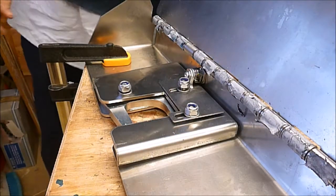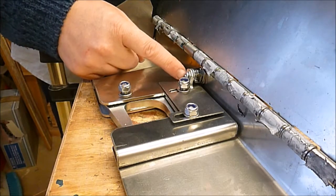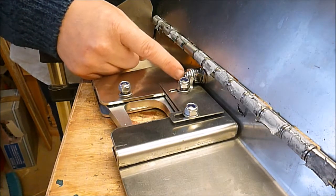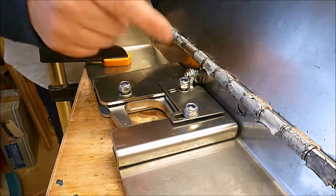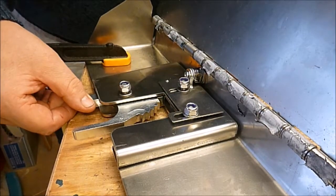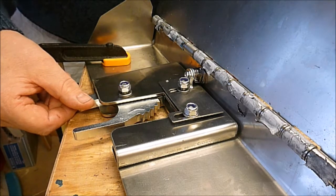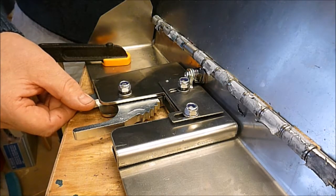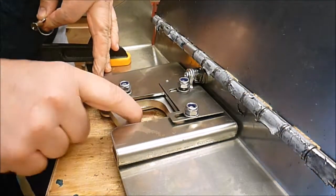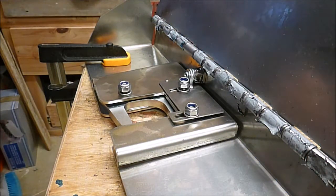We'll try that once more. Operate the key — you can see this bar here only moves a small amount. It's just pushing against the spring which finishes over here so that you can open the ratchet. It's not supposed to move more than a few degrees. Take the key out. As you push it in, that's the ratchet. The mechanism now works and I'll go ahead and tighten up those bolts.